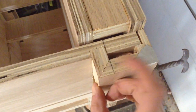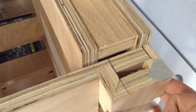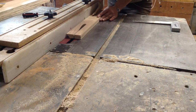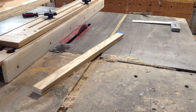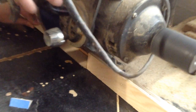I did a couple test cuts to get the right size for that last piece. You can see how now that's all going to fit into place and I can trim down this piece. I cut a couple of these slabs so I could adjust all the measurements. Once I had that, I could rip it down, take it to the radial arm saw, and cut it into five and three-quarters — because there's a three-quarter bit of detail at the top — and then attach all of these. I have a stop set up on the radial arm saw so they're all the exact same size, and I use this stop for all of the 45 cuts.